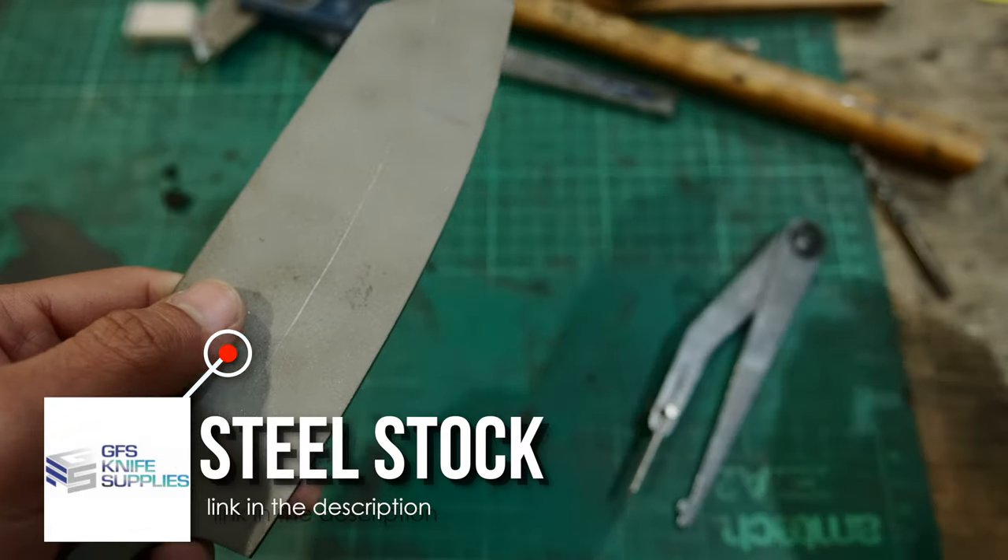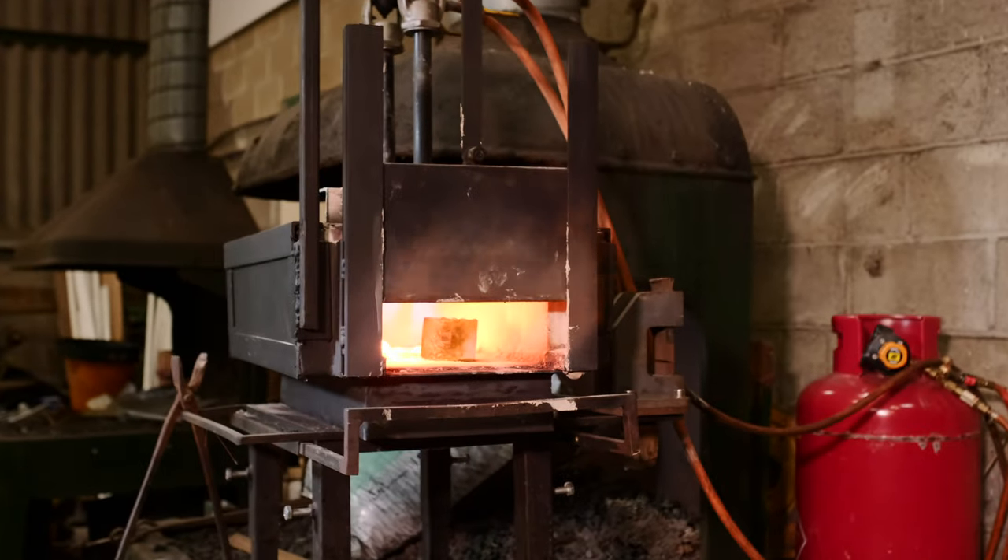If you've got stainless steel, you've got chrome oxide on the surface, and chrome oxide screws up everything. That's why it's stainless — you've got chrome oxide, nothing can get through it, and the crystals can't get through it either. So coming back to simple carbon steels, they do forge up quite nicely, but you've got to keep your surface clean.